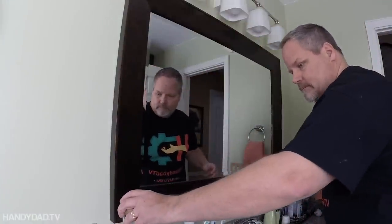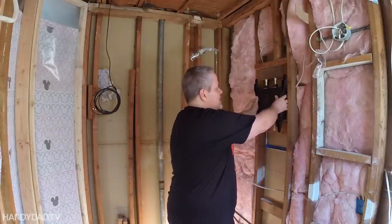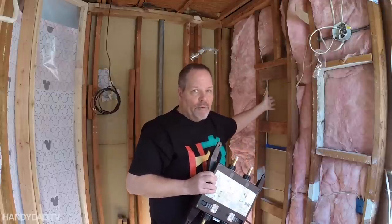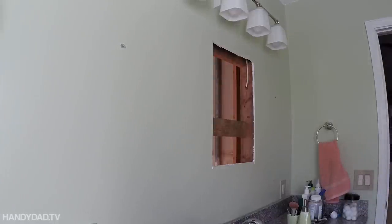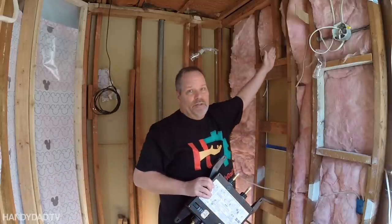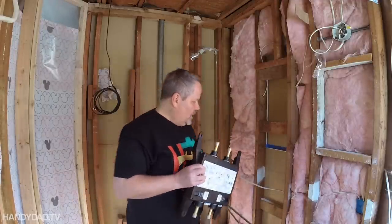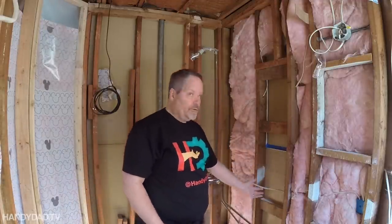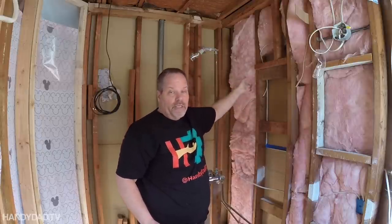On the opposite side of this wall is my other bathroom — they tend to put two bathrooms next to each other to simplify the plumbing. On the other side of this hole I've already cut in the wall is a big mirror in my other bathroom. This valve is going to get mounted inside this hole, and I can access it by taking the mirror off the wall. There's always going to be a mirror on that wall, so it'll be hidden. Plus I've got my incoming water right here, and the output ports will come right over to the heads. The wire connecting the two components is 30 feet long, which is plenty.